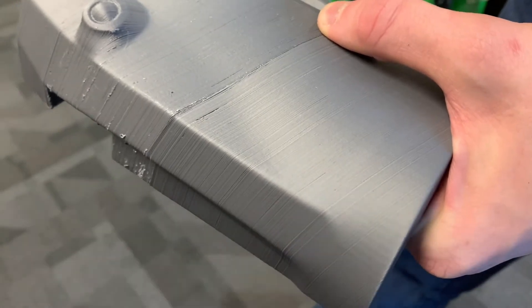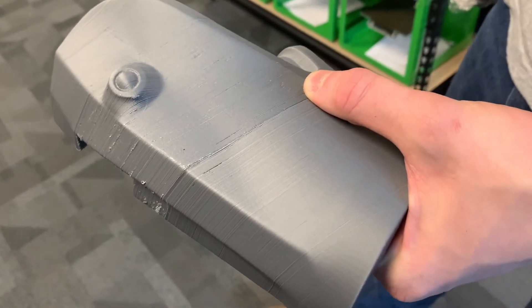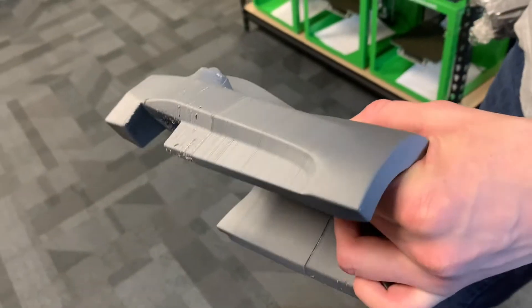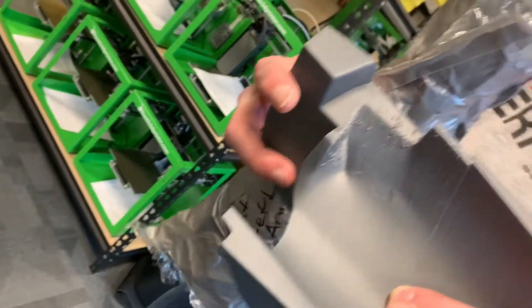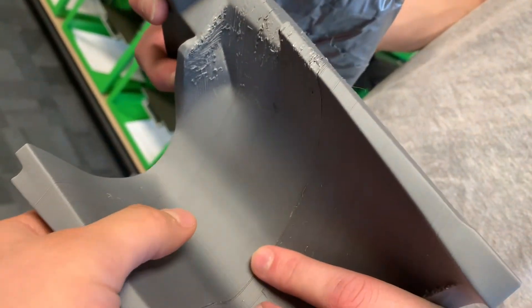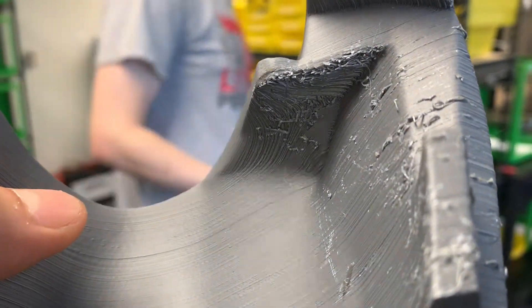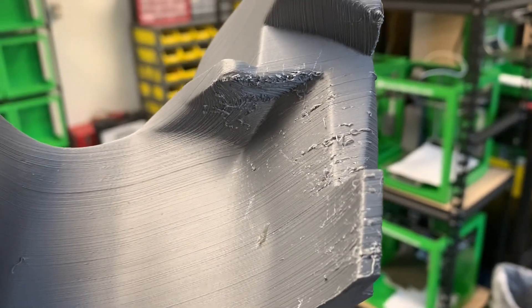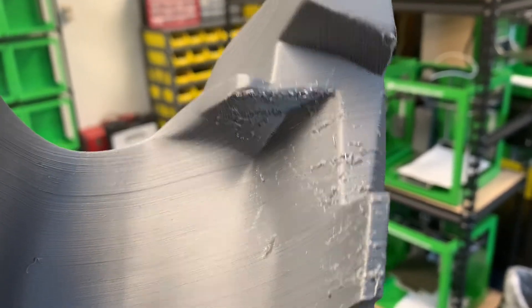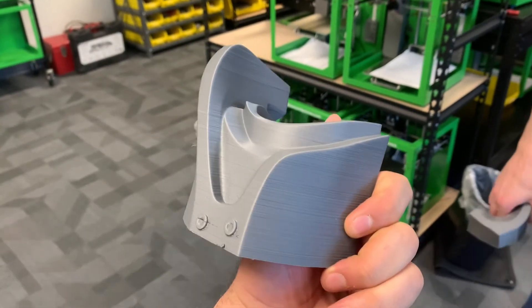To anybody who's new to 3D printing, you've got to remember it is a layer-by-layer fabrication method. What you're seeing here is pretty normal. Some of the stringing you see is because we really pushed our printers in an effort to bring down printing times, so this is not necessarily indicative of the quality you would see with a different set of parameters. All of this stringing had to do with unsupported overhangs — you can't print on top of nothing. We just used some pliers to pull the loose nibs off. This is an internal face so the audience won't see it, and by the time we're done sanding, we'll get the remainder of these stringy pieces off. This will be a turnkey part. For our first attempt, this is more than we could have hoped for, and we're really excited for what's coming next.